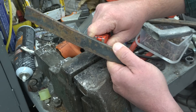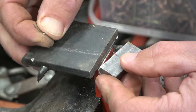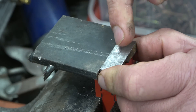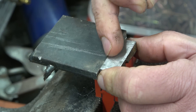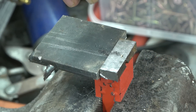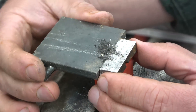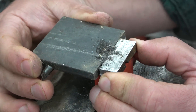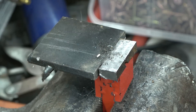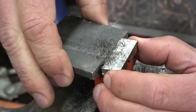However, if you have a crack — I'll make it pretend this is one piece of steel, I know it's two, but bear with me — what happens is that the magnetic flux has to jump this gap, and there develops a north pole and a south pole. And if we put some powder on there, then it sticks real good. And if there's the remotest separation, you can see it piles up all around that crack.